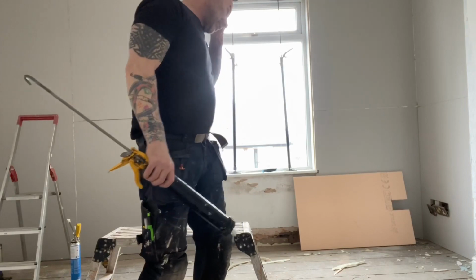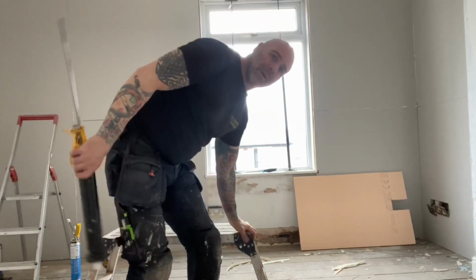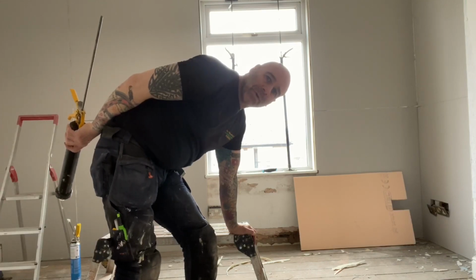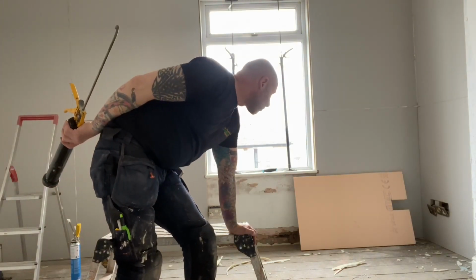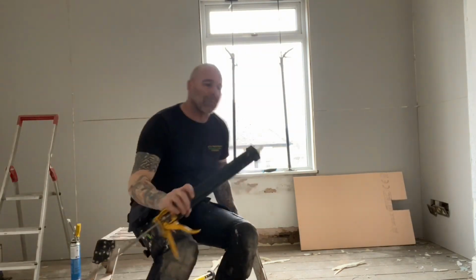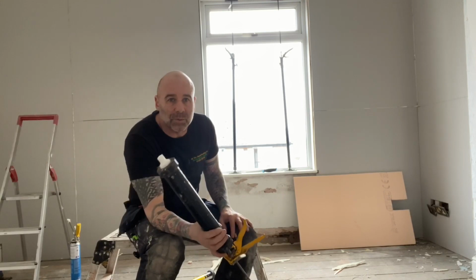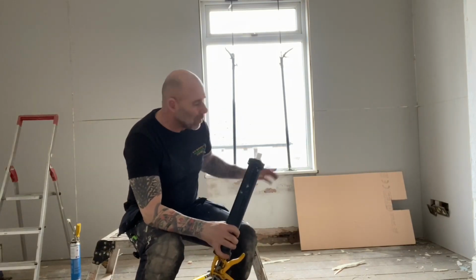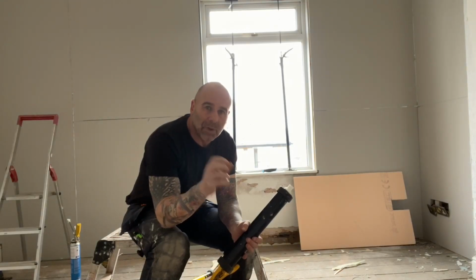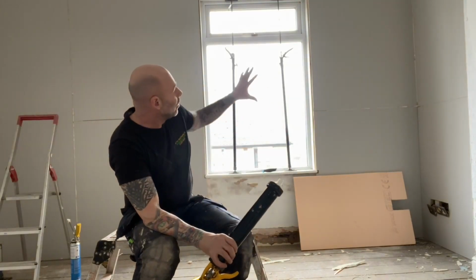These are 27mm thermaline plasterboards, and they're as expensive as gold per ounce. So they're quite expensive, but they do a job. And I'm fixing them on with acrylic, a bit like the express system that we use with plasterboards. So I'm going to fit them on with acrylic. So it's going to leave a slight gap, only a few mils behind here when we put it on.